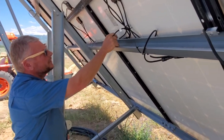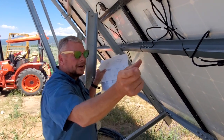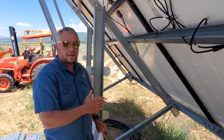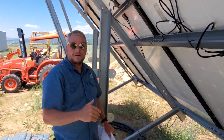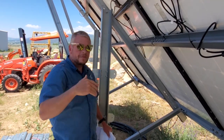Here are the solar panels we put in — these are 330 watt LG panels, 62 inches by 39 and a quarter inches, which was the kind of standard size. If you had to put wider panels on, it's not a big deal — it's just extending the ends as mentioned before. You can keep going with this thing: if you wanted a 20 or 40 panel array, you could just join end to end, space the beams further apart, and keep going with the same style. The hardware that comes with it could probably be used to extend even further.